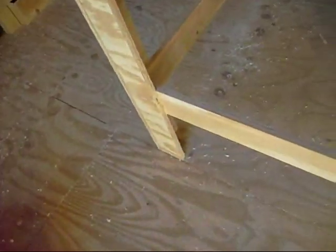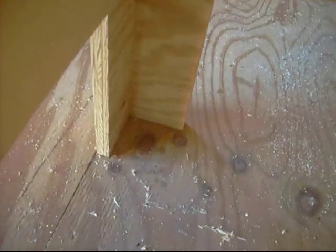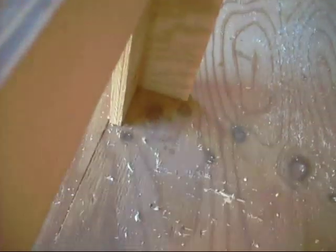Let me show you how this table is built. It's three-quarter plywood with braces underneath — you can see the brace in the middle and down in the corner of each foot. That corner is where I'll attach the leveling leg. My saw stand legs are two-by-fours put together with Kreg joints and glue — they're solid as a rock, but they're not level either.